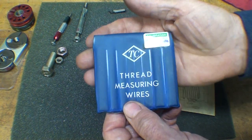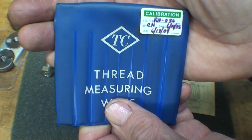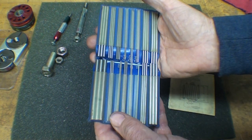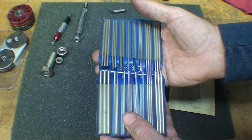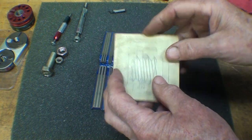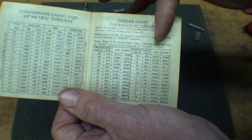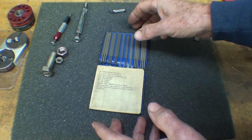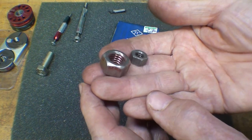These are thread wires — I've got a couple sets of these, and they are really a nightmare to use. They have been calibrated about ten years ago. These are most difficult to use because they're so hard to handle — they make special holders for these, and some people use clay and all kinds of homemade methods. How do you hold three of these into the thread, hold the micrometer, hold the work, and then you're going to have to look it up in a chart? So you can see this is something that is not good for beginners.